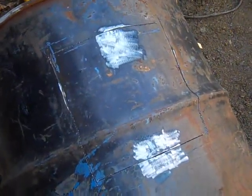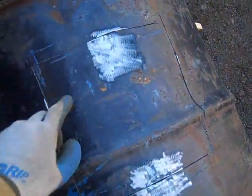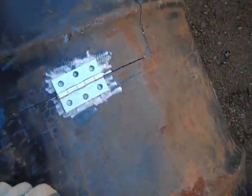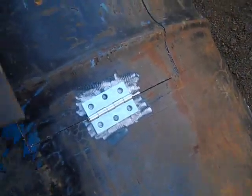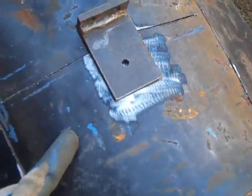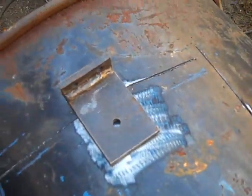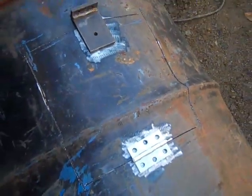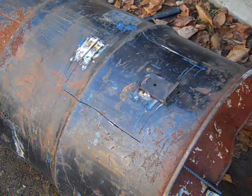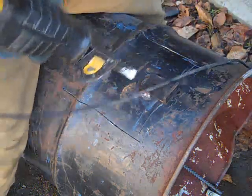I've cut the door for where the wood is going to go in, cut around most of it but I didn't cut the corners so it will stay in place because I'm going to weld a hinge right there. The door is going to fold up and I'm going to weld this piece of metal to the door so it doesn't swing too far closed. It's got some little holes in it so I can rig things up to hold the door open or for other things later. I've got the hinge and latch thing welded in place, so now I'm going to finish cutting the corners of the door.